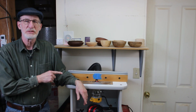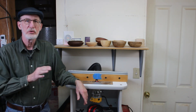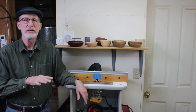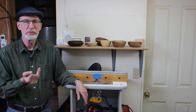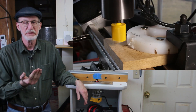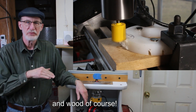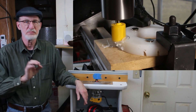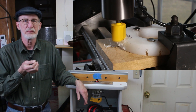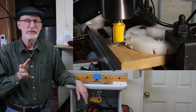Here's what I'm going to suggest: you can actually use router bits on your milling machine to machine anything that's non-ferrous. So we're talking brass, aluminum, Delrin, acrylic — all those materials are soft enough that a router bit running at very high speed works well, because they're designed to go in a pretty high speed machine. Just max out the milling speed on your milling machine, and you can use all of these router bits.